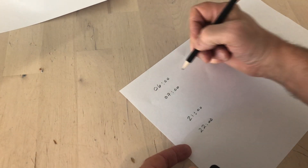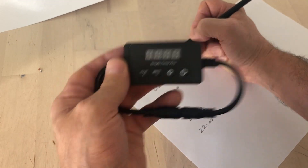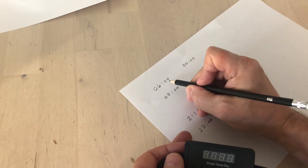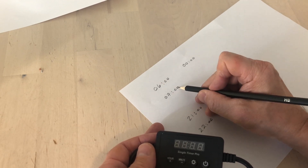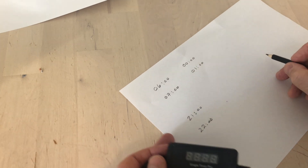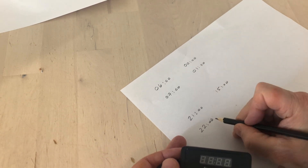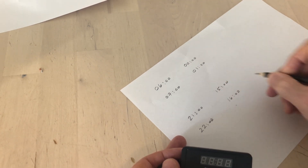When our IKEA timer goes off at 6 a.m., that turns this device on. When it comes on, it thinks it's midnight. So whatever we set for 6 a.m., we need to set it for midnight. 7 o'clock is one hour after midnight — that's 1 o'clock. 9 o'clock is 15 hours after midnight — that's 3 o'clock. And 10 o'clock is 16 hours after midnight — that's 4 o'clock.